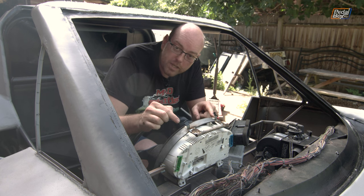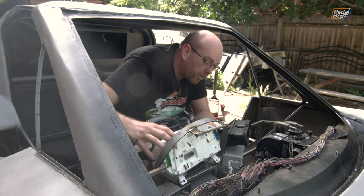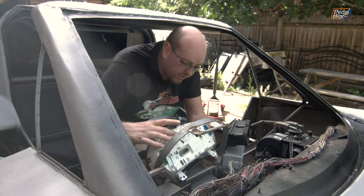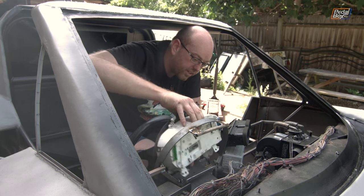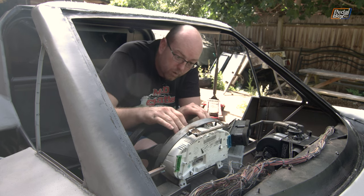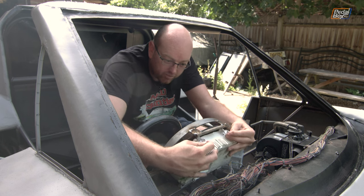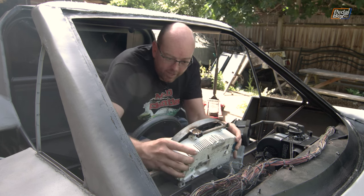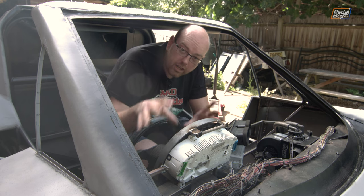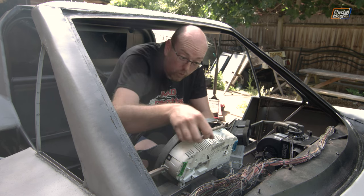I've bent these clips backwards a little bit, and all I'm using is some 10mm tube welded on a couple of stops at the back of this bar. To put it in, you just make sure the bottom tabs are over the two little standoffs for the bolts at the bottom. They drop in — there's a little skirt at the front so it's easier if you just put it in that way and it drops straight in. Then you push these down underneath, they go past, and you can get it right the way back. This part of the dashboard is going to come off so you'll be able to get in around the back as well. It fits in and holds really, really nicely — it doesn't move around and it doesn't seem to squeak. There's a little gap around the top, but that'll be taken up when we wrap material over it to hide the steel.